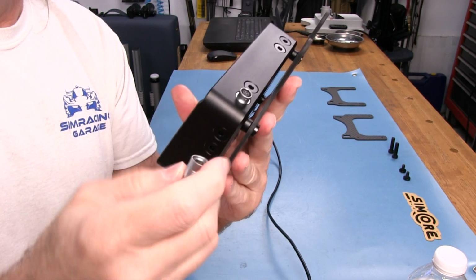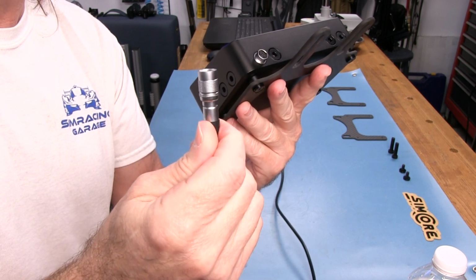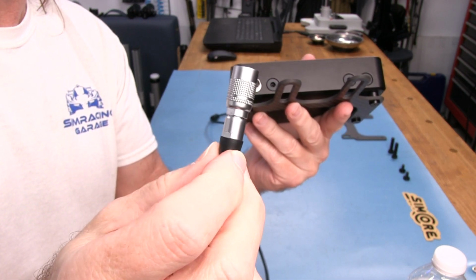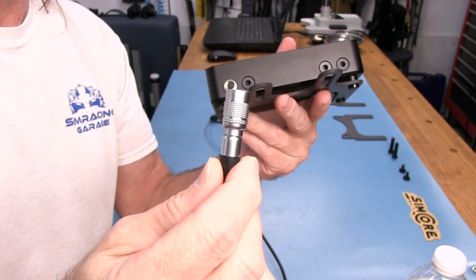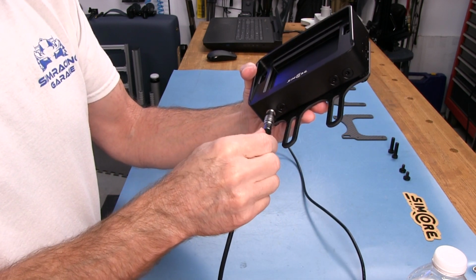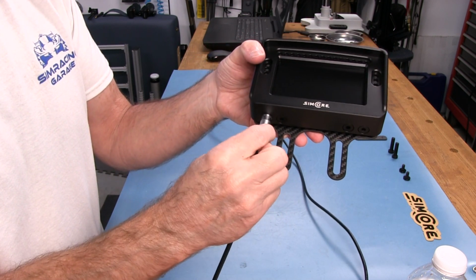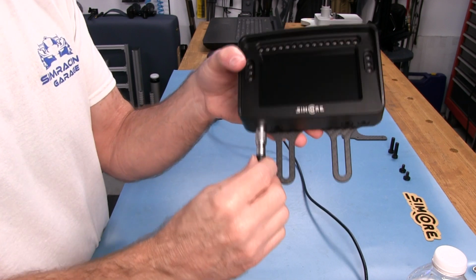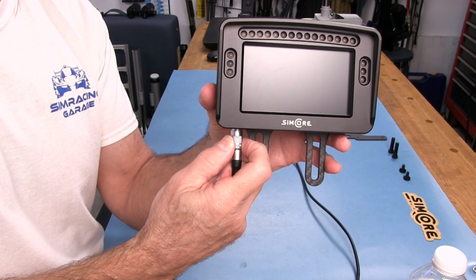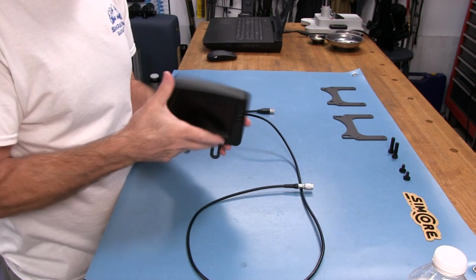Now, the reason I'm pointing that out is that there is a way to put this cable on. There are obviously no marks here, and no mark around the outside of this. So there are some slots, though. You see these little flat pieces on that connector? We've got one on both sides. They actually coincide with the ball bearings. So what you want to do is get the slot aligned with where those ball bearings are and just approach it like that, and then it'll slide right on. You can take the spring piece off yourself and push it on if you want, but you should just be able to push it home like that. So now it's connected. You just push it on and you're done. Then, of course, you take the spring loose to disconnect it when you need to, like that. Very easy. So anyway, very nicely done.